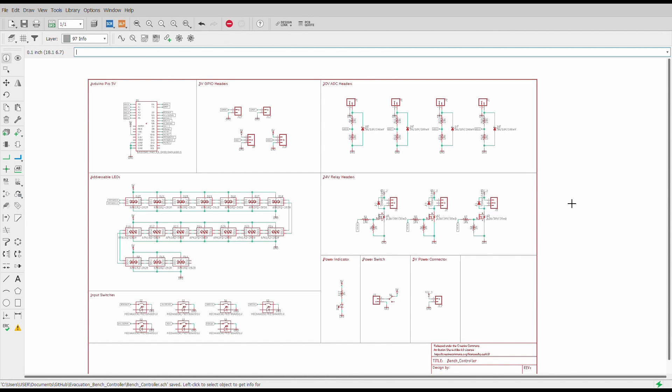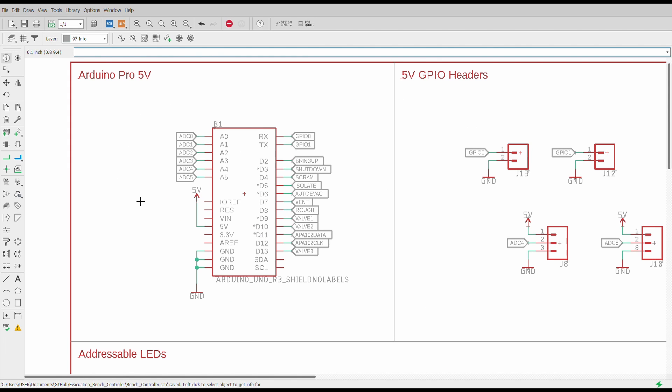This system is so straightforward that it would be reasonable to build it out of old industrial ladder logic controllers or even relay logic, but nowadays it's much more common to just throw an Arduino at it, so that's what I did. I decided to design a board that essentially acts as a shield for the 5V Arduino Pro. The microcontroller it's based on is an ATmega328P, which has a handful of ADCs, a bunch of GPIO, and serial communication built in. The ADCs are going to be especially useful since we have all of these analog output signals from the vacuum equipment that we want to keep track of.